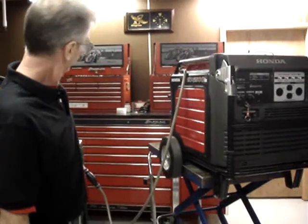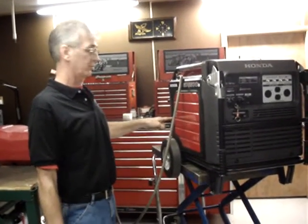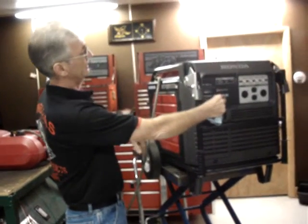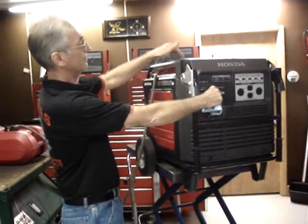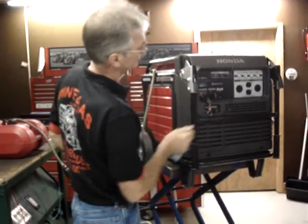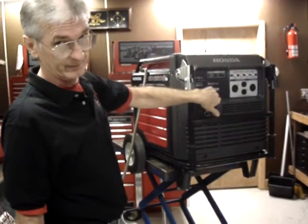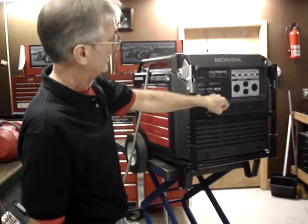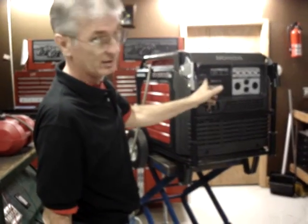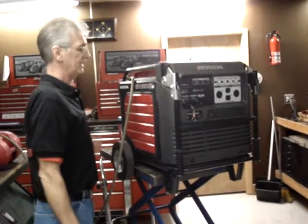Keep in mind, all you're doing is pulling fuel out of the remote tank, pumping it through this hose, in through this fitting, through the fuel pump, and then with the selector valve in the on position, it goes backwards through the fuel petcock and into the fuel tank where the air is purged through the stock fuel tank vented cap. But at any rate, to run it off the remote tank, you would then move the selector valve to the off position. So think of it as the remote tank, you put it in the off position. For the stock tank, you put it in the on position, which would be straight up and down. We're going to be running it on the remote tank now.